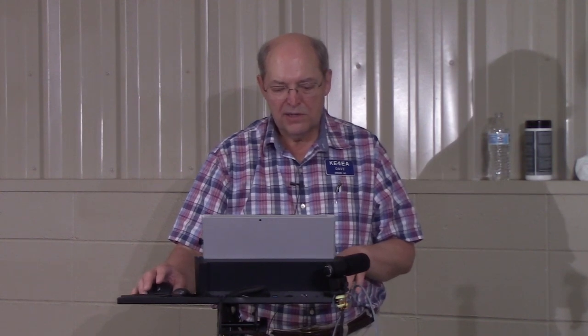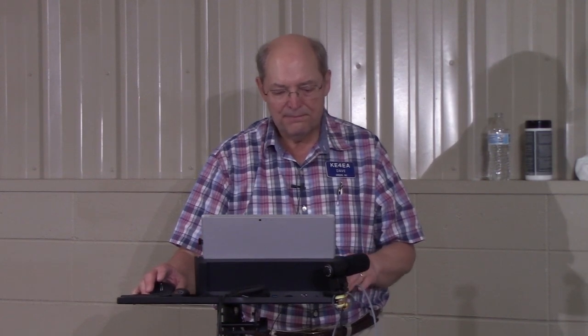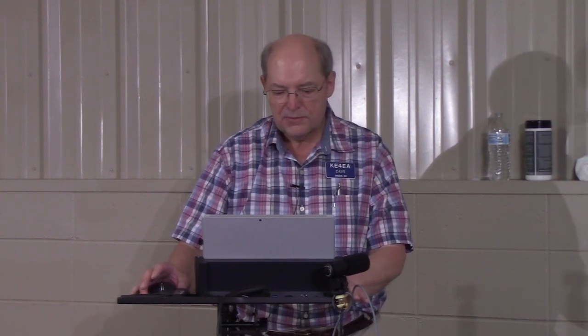There's a training period, just a few seconds, and then it knows how fast they can send and receive, and then they lock in. And then PACTOR 3 can exceed 5,000 bits per second. But we know we can only go 300 baud, so we've got some data magic going on there like we talked about last week.